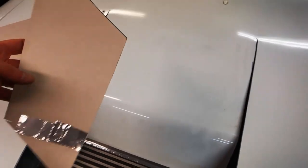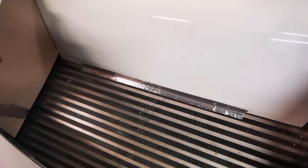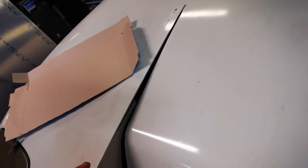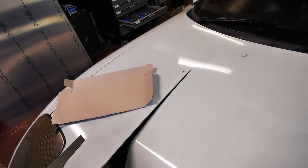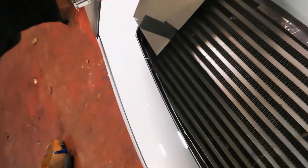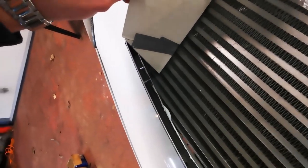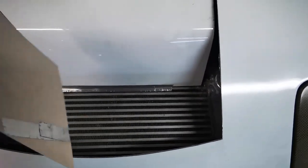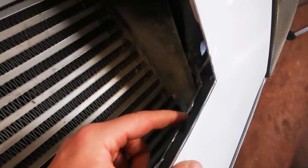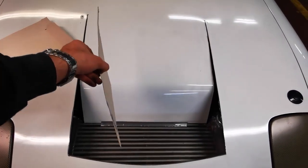So this is what we've got at the minute. That will sit down there and then tuck up against that. I've left that piece at the top because I don't want to cut that real skinny piece out of one single piece — I'll get this piece in and then finish that bit off when the bonnet's off the car. This front piece will just get put down there like that with a plate to match up. This side is exactly the same shape; the only difference is I've not trimmed it enough on this side, so I'll just trim that on the bonnet and then make two of these out of ally and they'll both fit.